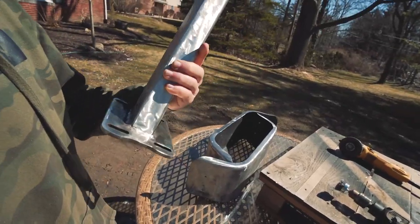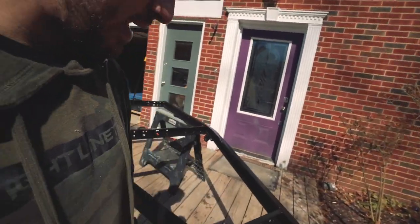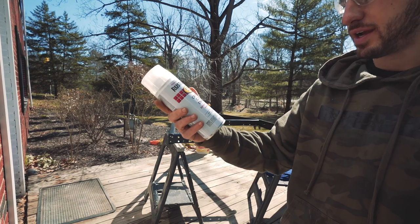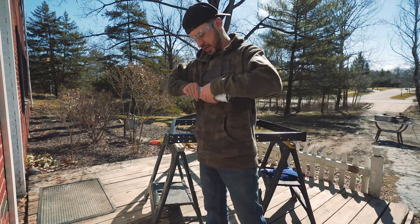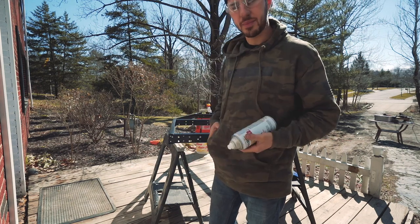The finished product looks pretty good, so we're going to get a coat of primer on those parts. But since the sun's finally warmed up and the trailer has warmed up a bit, we're going to try to get the clear coat on the main trailer first. I'm wiping it down and then spraying - I bought some Rustoleum crystal clear enamel. Sticking to enamel since this is going in water. We're going to do the whole can with a coat about every 10 minutes.